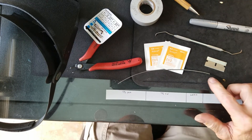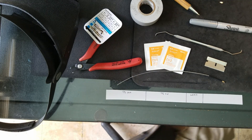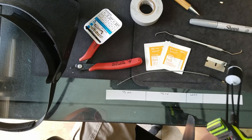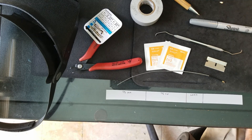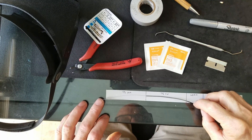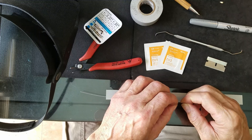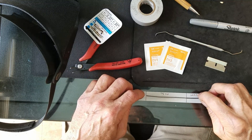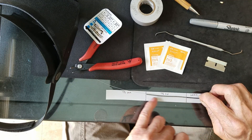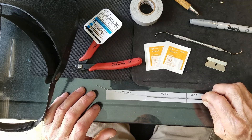That tail gets me underneath the platypus and into the Diversity Nano receiver, as seen here. This is one I just completed but haven't trimmed the feed end to total length yet because I still need to secure the ground plane. The ground plane is right at 78 millimeters — exactly what you need. Once I secure it, I use super glue, and then I'll trim it to length and put it in the feed tube.